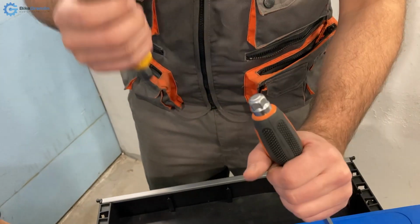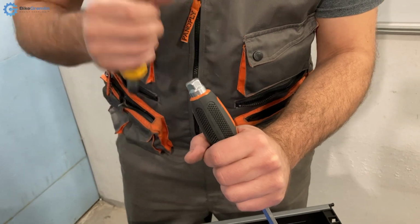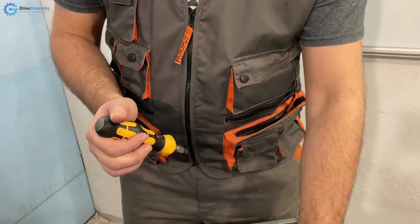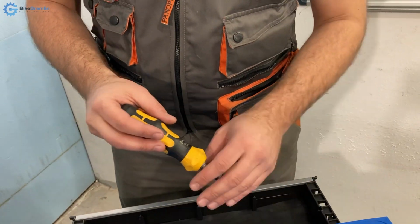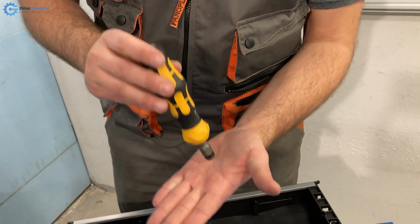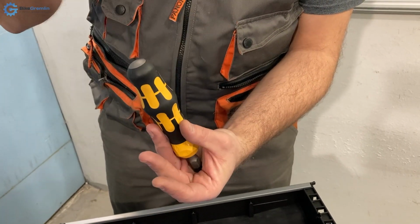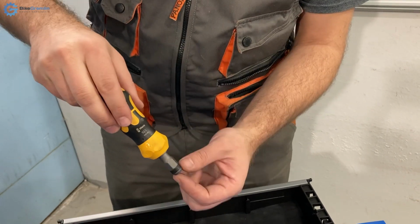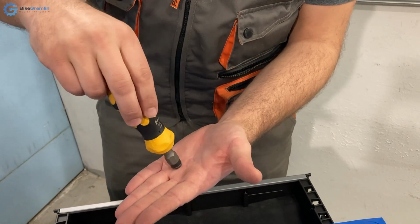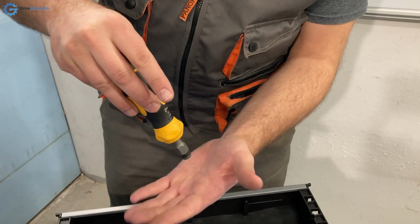So first you want to hit the bolt to get it to loosen by striking it with the screwdriver, and then I usually like to leave this aside and use the impact screwdriver. The impact screwdriver lets you hit it with the hammer, and at the same time, when the hammer is hitting it, apply downward force to prevent the screwdriver's tip from coming out of the bolt or screw. At that time this is also turned to unscrew.